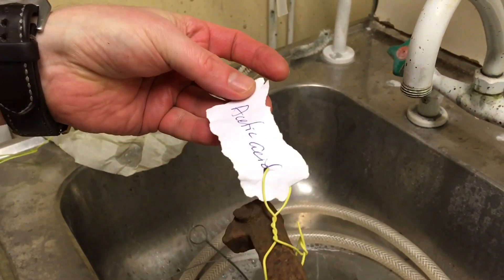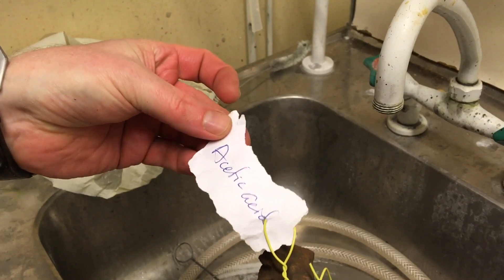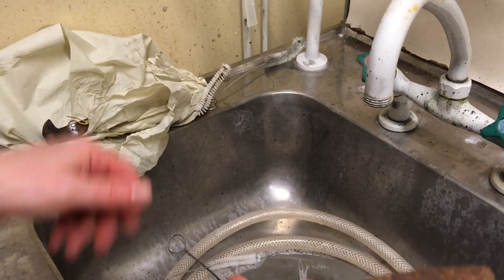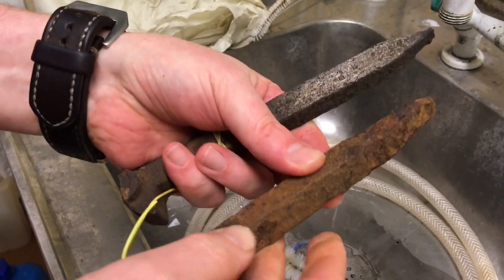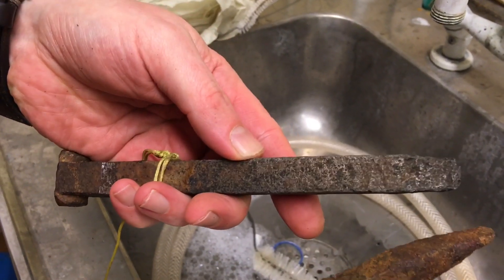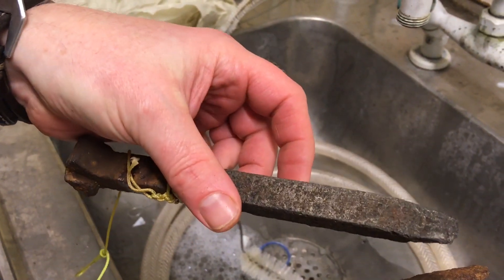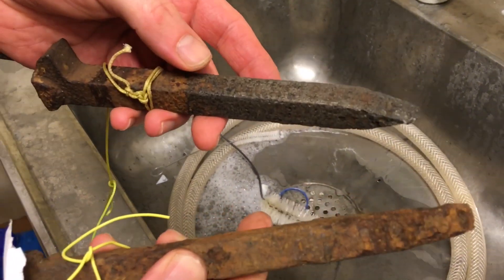For comparison, here's the nail that was treated in acetic acid at 30 times higher concentration — without electrolysis. In my previous video comparing different acid strengths, this was the weakest acid I tested. But it was 30 times higher concentration, and after one hour in the acid bath practically none of the rust came off. Whereas by adding electrolysis to assist in rust removal, I only needed one-fifth the acid concentration and got this result. In the next video, I'll show you how I set up the electrolysis path.